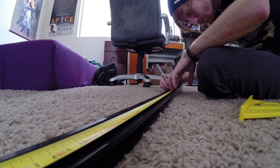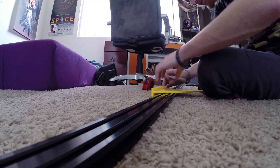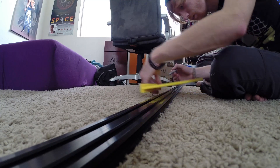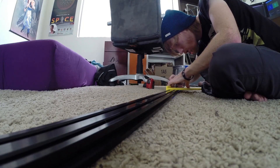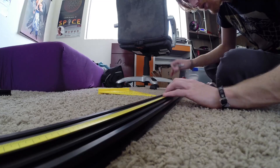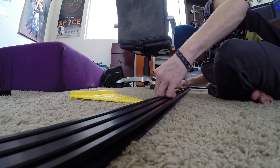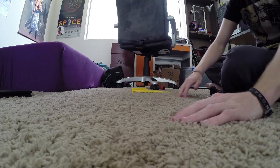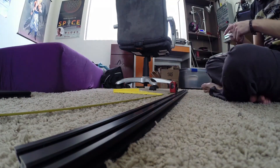In preparation for cutting everything, I marked lines in silver Sharpie and used a speed square so I could make sure I drew the measurement lines straight across, just to keep my life a little bit easier when cutting. I ordered all of these aluminum extrusions from the OpenBuilds parts store — had them in more or less standardized lengths so that I could dimension my printer around these extrusions. I used the length of a single standard extrusion as the overall height and scaled the rest of the printer around that, so the four vertical posts on each corner of the build were a full pre-cut length.